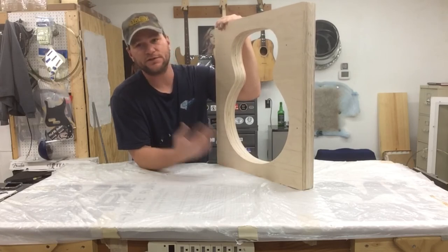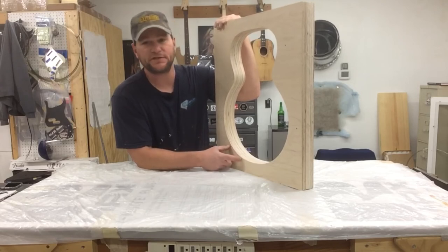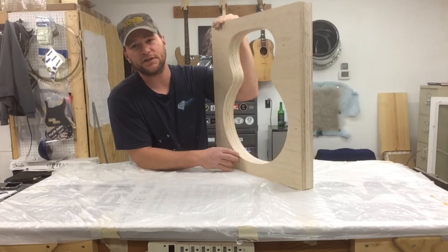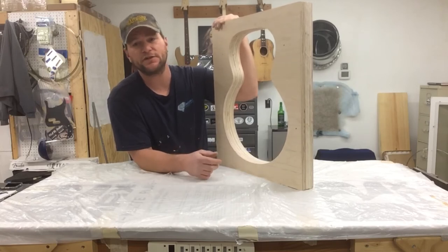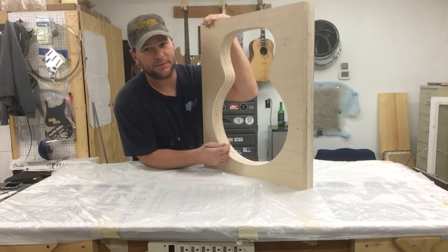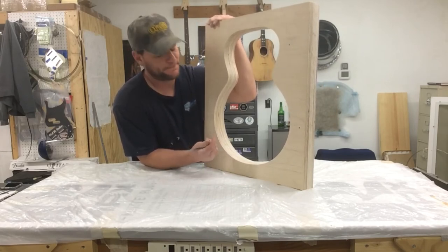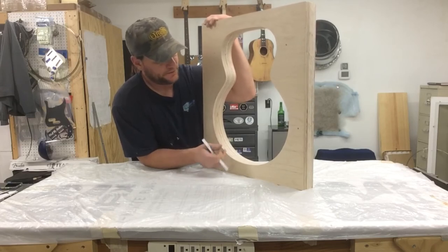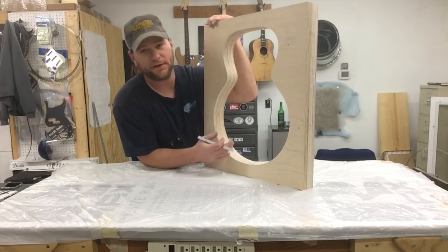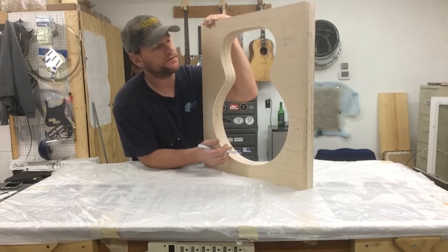Ideally, what you want is two molds. You want a mold that's basically the thickness of the side, the height of the side, and then one that's going to give you like 3/8 of an inch on either side. Ideally, you want to be able to clamp on the kerfing on either side, and you will be able to. And then you could level on a surface plate or a radius disc, the kerfing and the sides and everything.